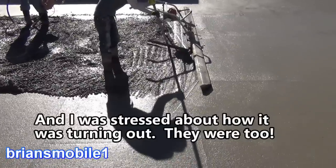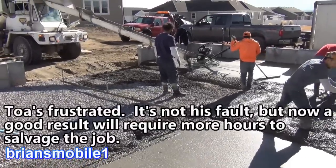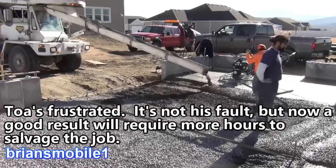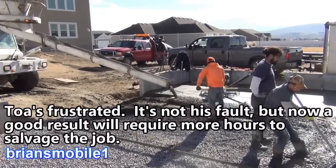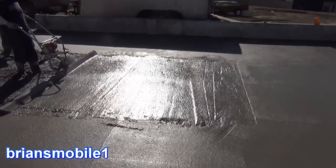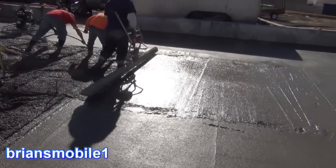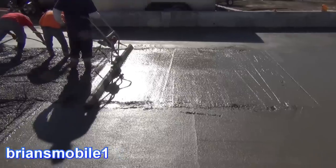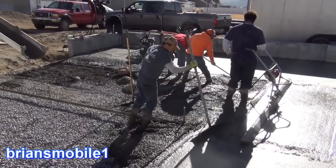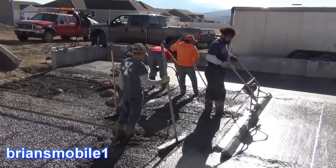You can see he's tamping hard trying to get liquefaction going again — telling him to get it up so it splashes in. You've got all the air pockets that have been forming the whole time we've been waiting for the truck. But all the rest of this would not screed for anything — it's just too hard on the sides. It's hard to get it exact when it's been sitting for 40 minutes. I was frustrated and I caused the problem and I didn't know it, and that added to their frustration.